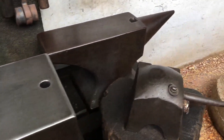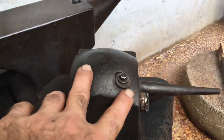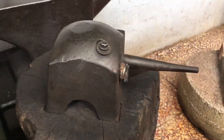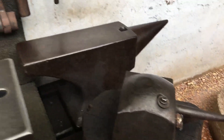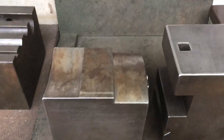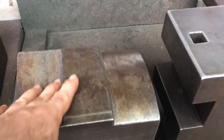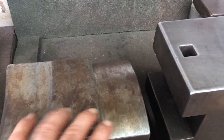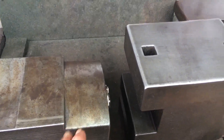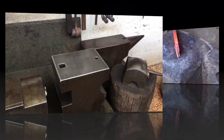This is my everyday anvil, and off to the right is that little bread loaf anvil. What I need is an anvil that has a convex face, but not quite as much as that. That little bread loaf anvil doesn't have much rebound. I have this other anvil here lying down — the face is really rusted, no big deal — and one surface does have a lot of radius, but it's only front to back. I've been observing others and noticed this could be especially useful for edge tools.